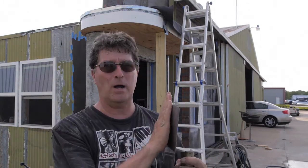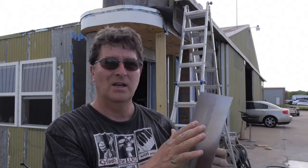I noticed that Kirk was using a pool trowel, which is rounded on the ends, but I couldn't find one. So I used the next best thing — I found a stainless steel one. They say that if it's not stainless steel, if it's regular metal, it'll rust and might put stains into the stucco. So I got a stainless steel one. Anyway, it's going pretty good. I've been playing around with the mixture levels and the goopiness and dryness of the stucco, and it seems to be going pretty good.